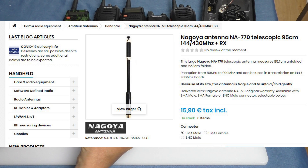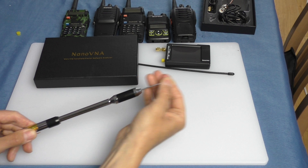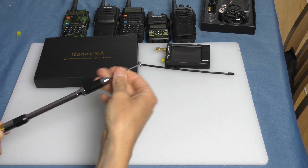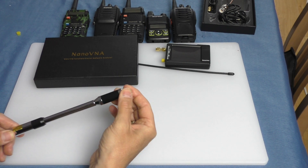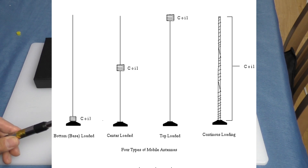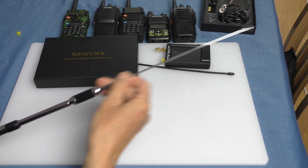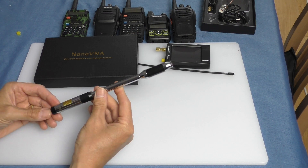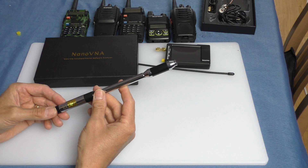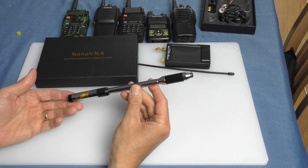Although it's a clone antenna, the advantage of this one is that it's perfectly tunable because you can expand and contract it. It's supposed to be center-loaded with a coil inside. I'm not going to take it apart because I use this antenna and don't want to ruin it, but whether that center-loading is genuine or not I can't say. Because it is tunable it claims to be a very wide-banded antenna.